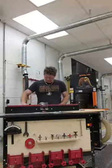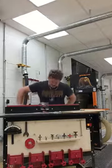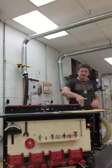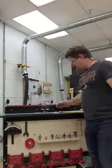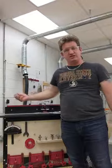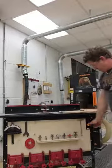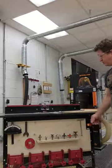Then you want to locate your fence back into place. You can micro adjust to get it pretty close. If you're using a bearing, make sure the bearing is in line with the router table itself. There is also a speed adjustment for the router — you have to get to the router and dial in the speed, which is available on the back side. When you connect back to power, the switch is right here to turn the router on. Make sure all your tools are out of the way.